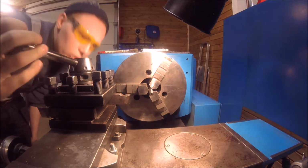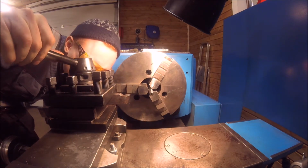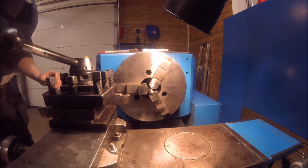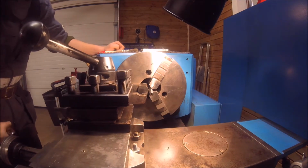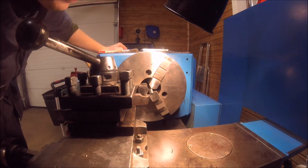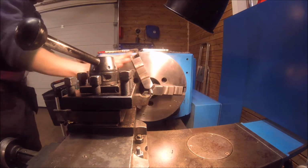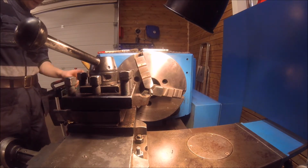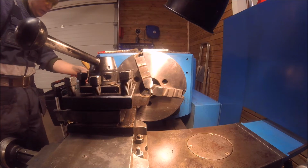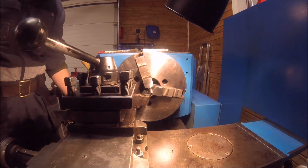This is an ordinary brazed carbide tool bit with the tool steel being, I think, T10K5 tool steel, which is Soviet tool steel, quite good on hard materials, I don't know. It's a bit low, but I will see if it will work. I don't really feel like changing the tools right now. I'm going to first attempt to run at 450 revs and see how it works.